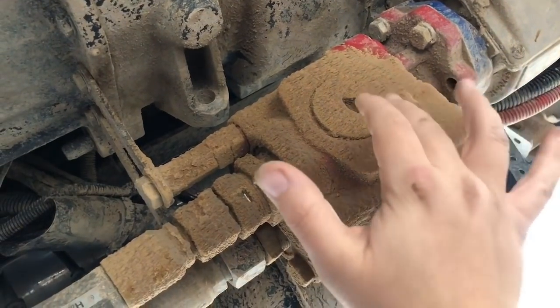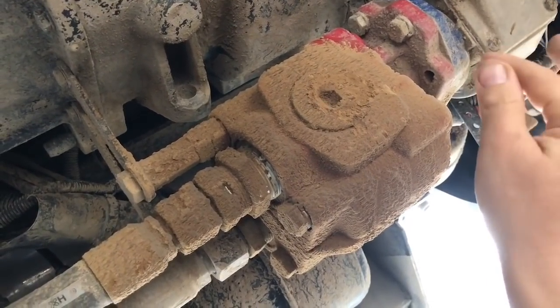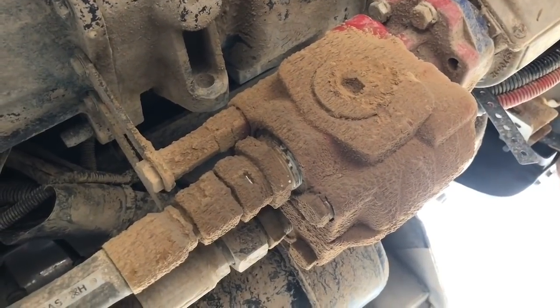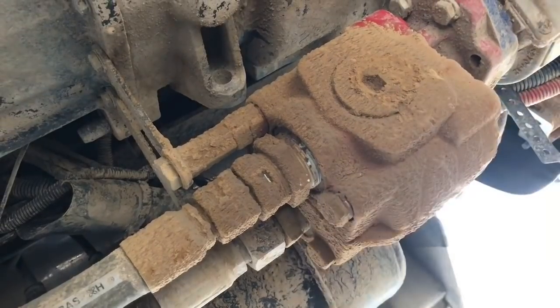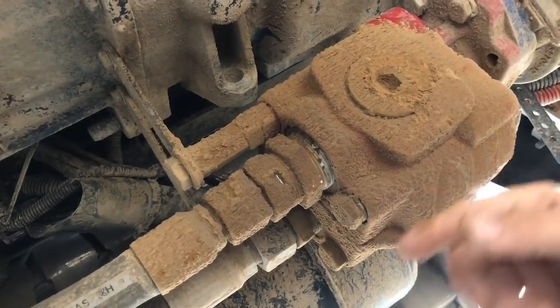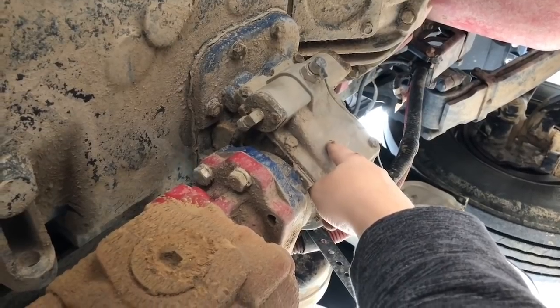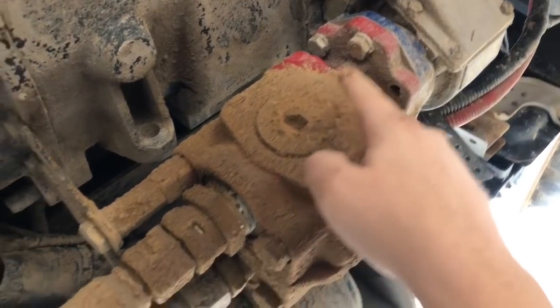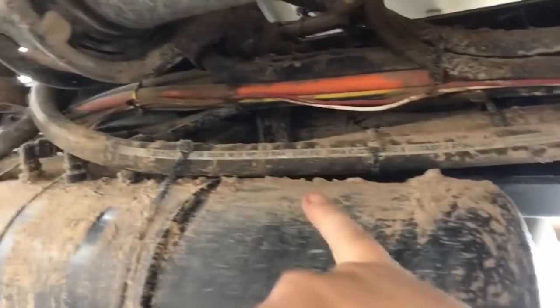Basically I came off the back of two plates of metal, bought longer bolts to go in the transmission, and bought threaded collars to make my own support bracket. This body is aluminum, so you have this big pump hanging off the back of the PTO going down rough dirt roads - if there's nothing to support it you'll crack the body. This is a max pressure 3,500 PSI bi-directional pump, meaning it will flow either direction. This is a 148% PTO driving a 27-gallon-a-minute pump. Then it's just a matter of running your lines - I ran mine over the air tank, staying out of the way of the drive shaft.